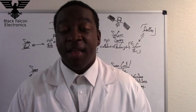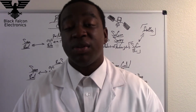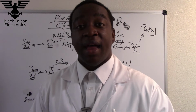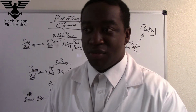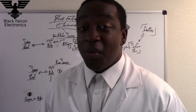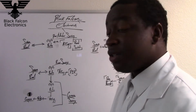So to avoid that capability of some company X, let's say, being able to spy in or see what's going on in my house, see and hear it, that's why I have the camera electrically connected to the Camera Sentry, so that no matter what, I can say deactivate. Again, the companies can easily say, okay, well, the camera's not going to send alerts, but we still have the capability to see. If it's electrically disconnected, it just deactivates. There's no way around that. There's no backup battery or anything like that that'll last long enough for them to get any kind of real information. So that's why you just electrically disconnect it.